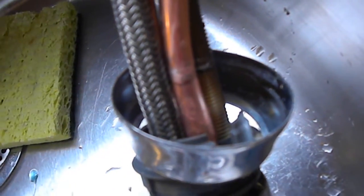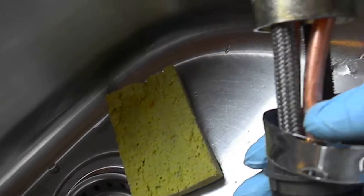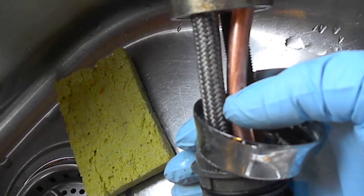What had happened was, the way it was mounted — this is the bottom bracket mount — and you can see it's got a little bit of corrosion or stain there. I guess because of electrolysis, this mount had eaten a groove in the copper right there. You can see it's kind of stained, it's a white stain. And if you look close, you'll see there's a little bitty crack right there.